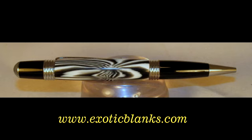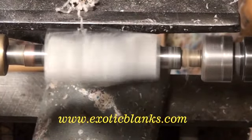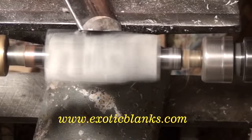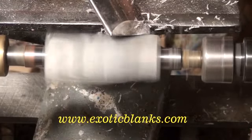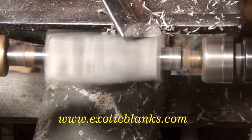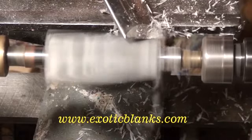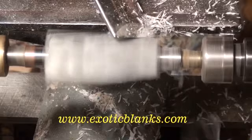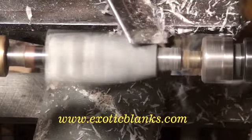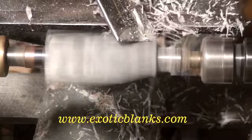That will tell you a lot as to whether you're chipping out or how you're getting on. You can hear the chipping as I'm turning this. Even though I'm getting the ribbons to come off, you can hear that it's actually hitting each of the corners and it would like to shatter if I were going deeper than I currently am. When I start this material, I go into both of the two ends first.